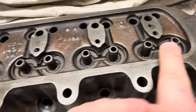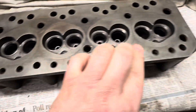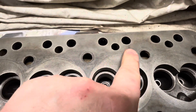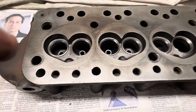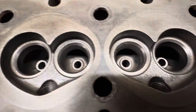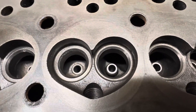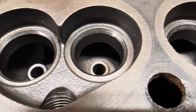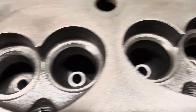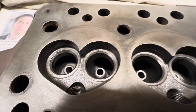Obviously the original guides we're going to be replacing. Let's turn the head over and see what we've got. We've actually got a very nice deck on that one, and you can tell by the planing lines where that's been machined — that's all factory machined, so that's never been skimmed. Where I've decoked it using a rotary wire brush on the end of a drill, we can see the chambers are in pretty good condition. The actual valve seats, well, they're not such good condition — they're quite pitted. But we're going to be fitting unleaded inserts, which will repair that and convert this cylinder head to unleaded.